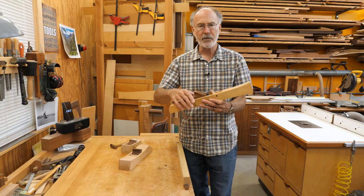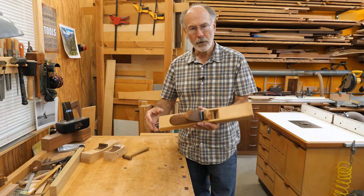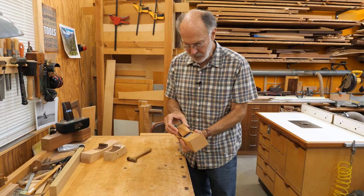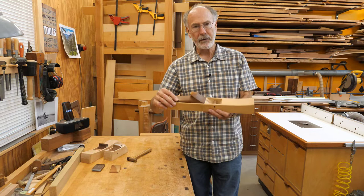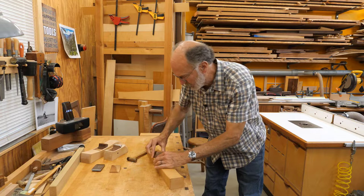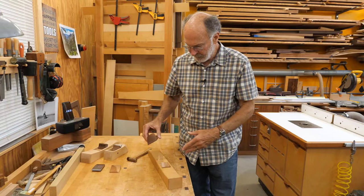I'm going to show you how I made this handle and how it's attached. The first thing I need to do is get the blade out, because this handle comes off vertically. I'll tap the back here — that loosens up the wedge — and now I can get to the handle. This handle is held on with some dowels. I've got three holes and three dowels, and that's all it takes to hold this on. I'm really only pushing forward and down on it, so I don't have to worry about it sliding off.